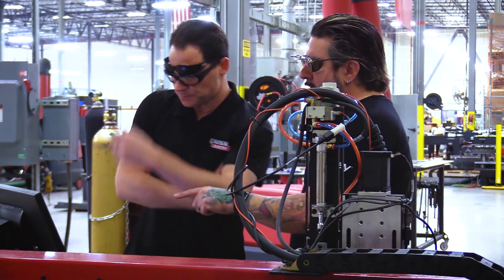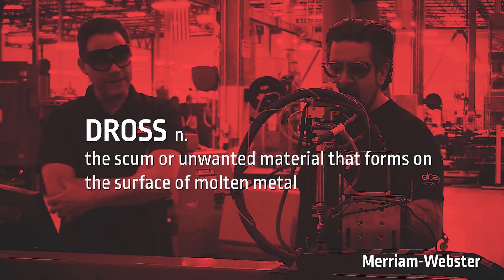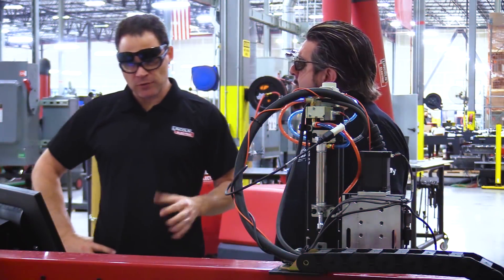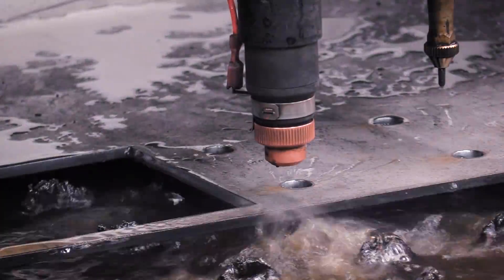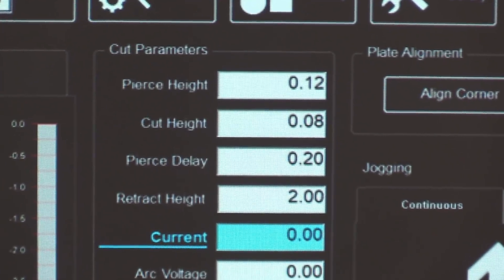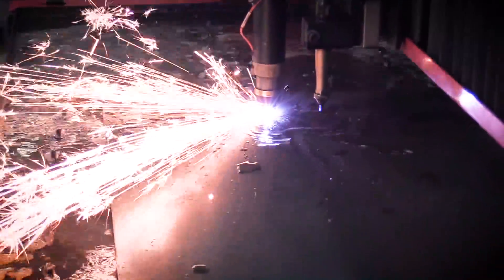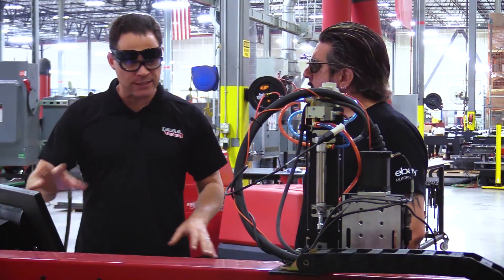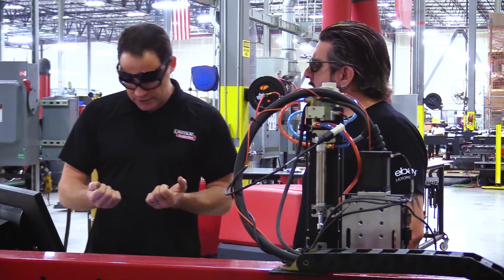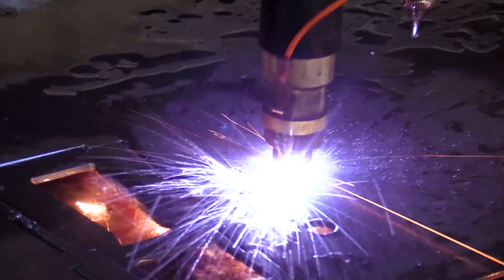How do you control — I'm going to call it slag, but it's actually called dross. Most of the time, dross is because of feed rate and settings. Our AVHC settings — which is the pierce height, cut height, pierce delay — and then our feed rate, which is the speed the torch travels, are going to directly contribute to more or less dross. My goal is to set this thing up to have very little to no dross, because my manicured nails can't handle picking that off.